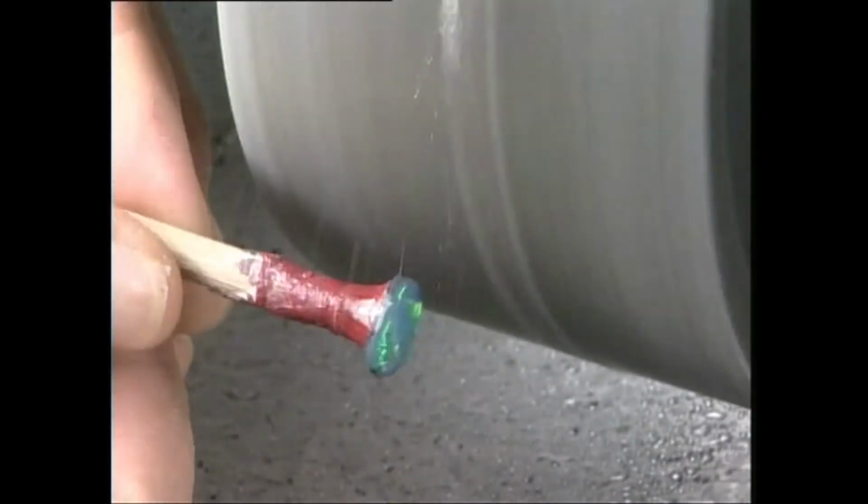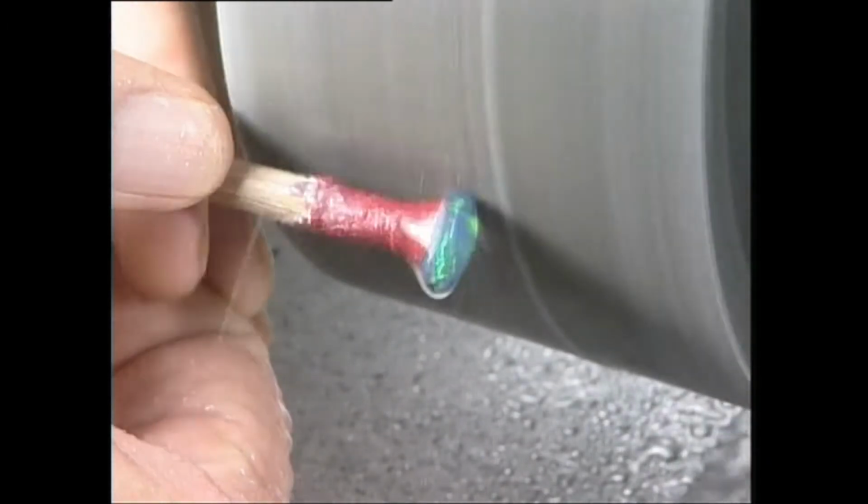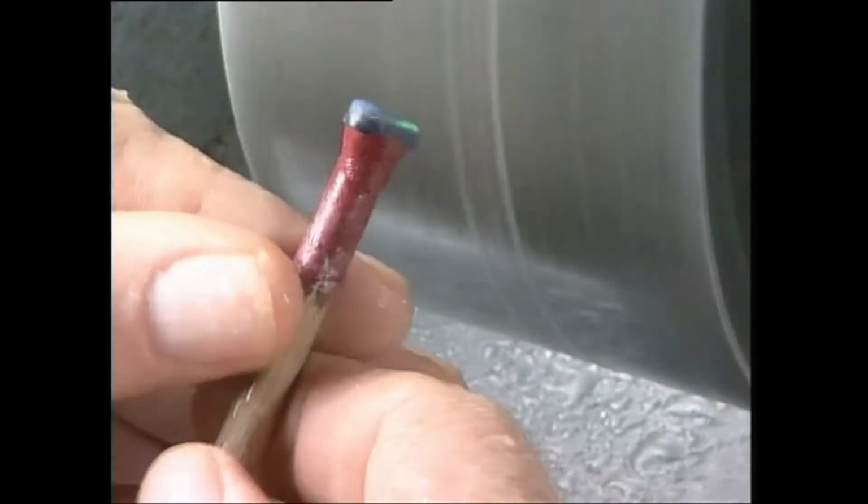Now we're going to sand them. Adjust your water flow on the sander. Using a 600 grit belt here, starting at the angle that the stone was cut at, doing the setting edge first. We'll show you that. It's a fairly sharp wheel, this one, it's fairly new.